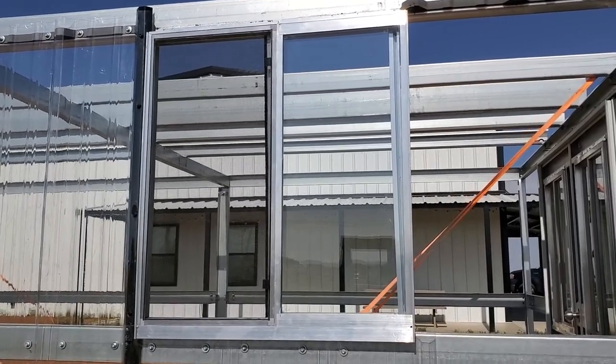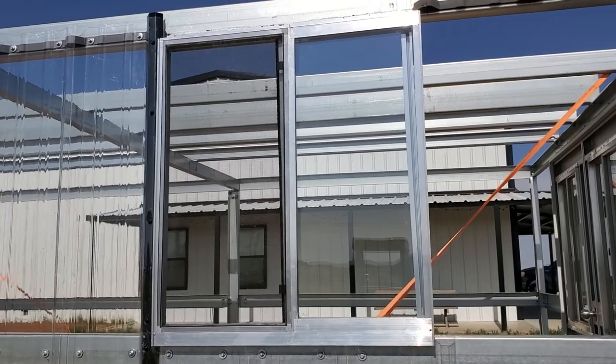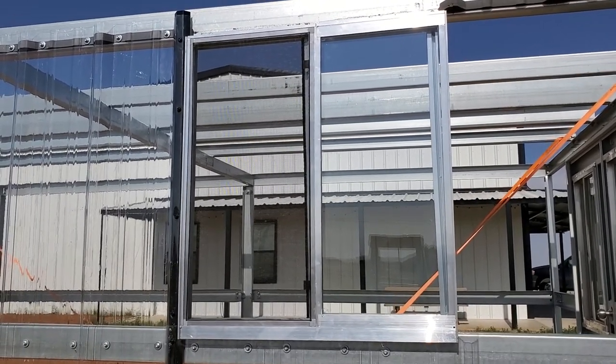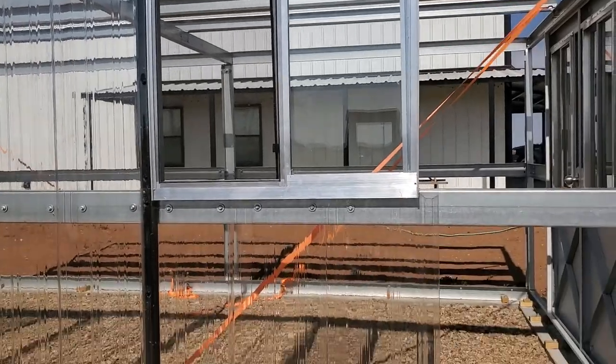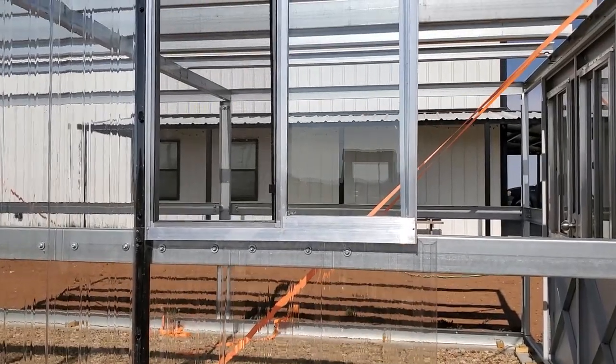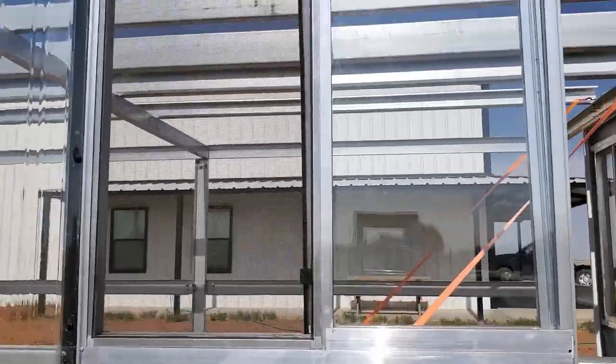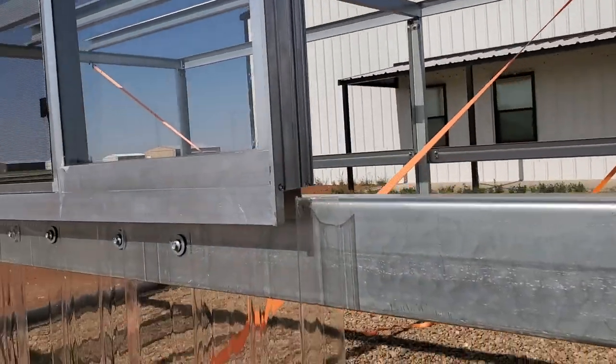Okay, so putting it up without the fins and then tapping the fin in behind the lap stiffener and the sheeting actually worked out pretty good. And I didn't have to cut or notch that bottom sheet at all. It's still an entire piece. So first thing I did was without the fins, I went ahead and set the window up. You saw me do that.